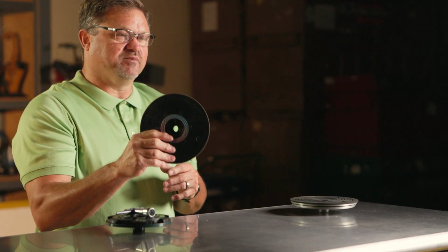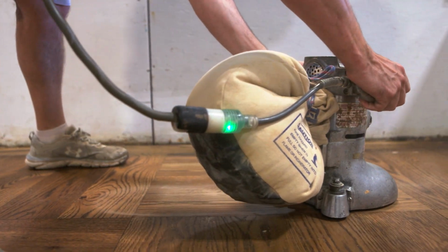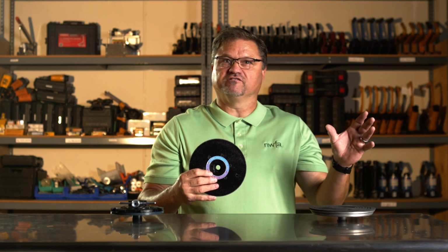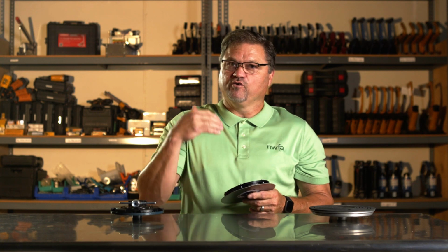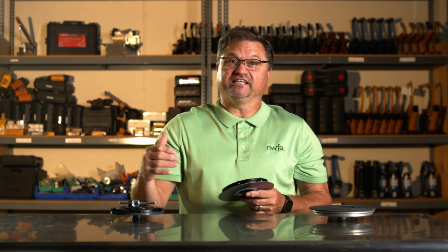Here's the big factor for me. We had a new guy on that job. I said, wow, this is easy. Now, all of you know that I give the new person the big machine first. If you're going to do damage to a job, it's right here, it's with the edger. When that person's edging and doesn't have the skill set to get it flat, hide the scratch, you're going behind him with a lot of extra effort, energy, abrasives, whatever it takes to get that floor flat and scratch free.